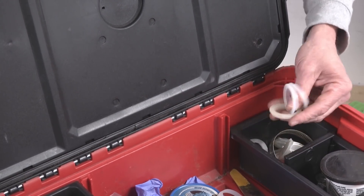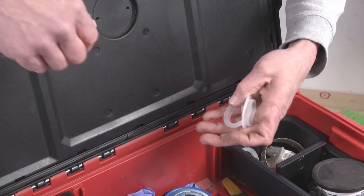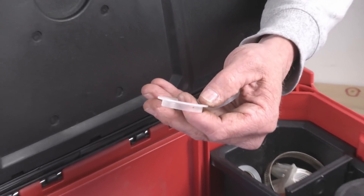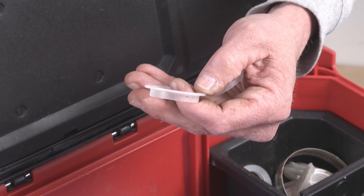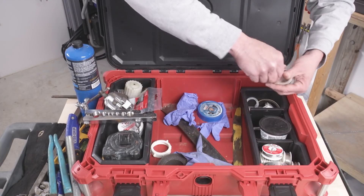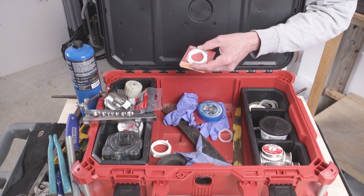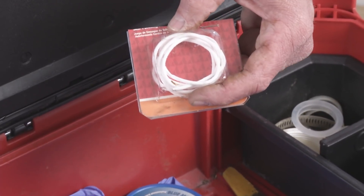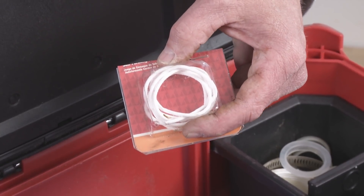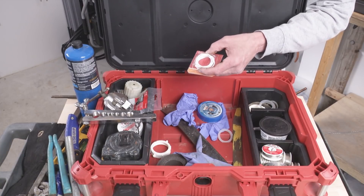This is interesting. These are washers for slip joints for metal traps, and this is the one that attaches the tail piece to the strainer basket on your kitchen sink. If you've ever wondered why that's leaking, it might be because someone put the wrong washer in there. If you have leaky valve stems, this Teflon packing is what you use for resealing the packing nut. You wrap this around two or three times, tighten the nut, and it'll stop the valve stem from leaking. People get way more involved than it needs to be — oftentimes you can just fix it with this thing that costs like two bucks.